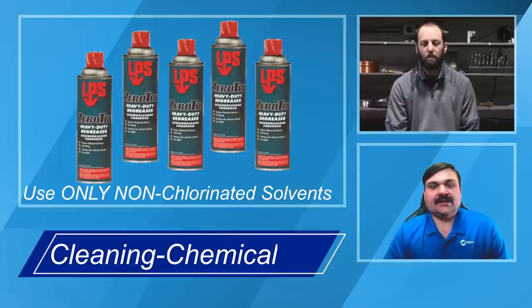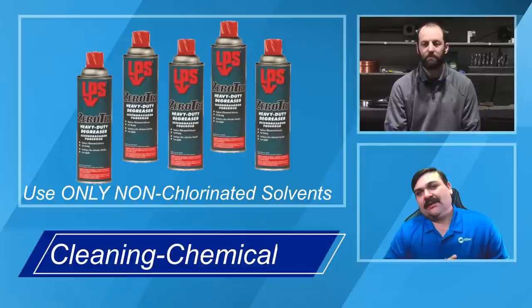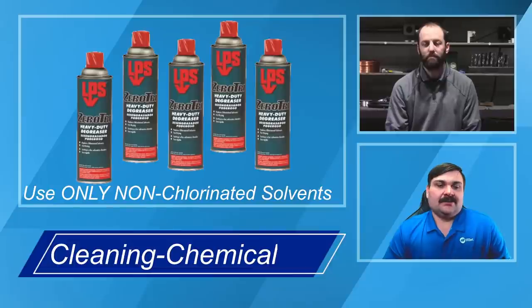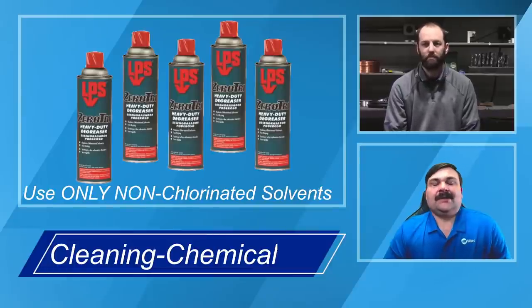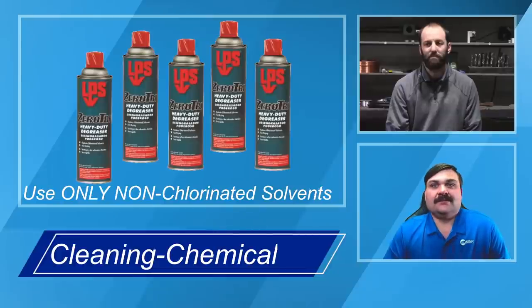Yeah, and that's a good point, too. Even with the microfiber towels and stuff like that, a lot of times those chemicals you might be using as a degreaser might also break down towels that are not cotton-based, where you might actually be somewhat melting them and dragging some residue into that surface as well. So, like Andrew said, typically the white cotton is going to be the best. Even the blue shop towels that you get in the rolls, if you wipe them across the windshield of your car, you're going to see they leave a streak from a different compound that's inside of those as well.